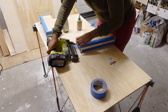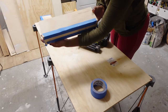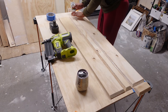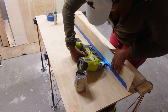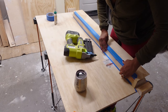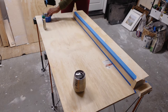This was my first time building floating shelves this way. This is actually the most advanced way you can build a floating shelf based on what the internet says, and if you're not afraid of making beveled mitered cuts, I think it's a great method and it looks really nice. But you do want to go very slowly — do not rush, especially when you're putting the brad nails into the wood around the sides to secure it. I found I was getting a little rushy towards the end, and some of the nails went through the plywood in a weird way and were poking out the top. They are very hard to get out after they're in all wonky, so take your time and make sure all your brad nails are shooting in straight.